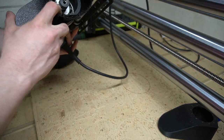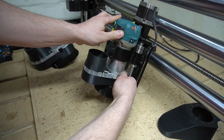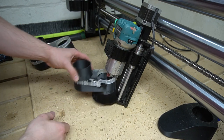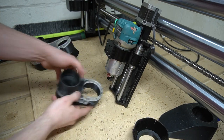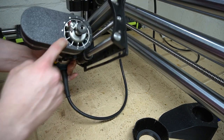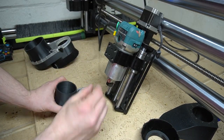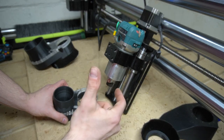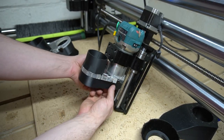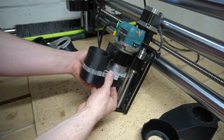The way I designed this is that the hard plastic and the collet nut are pretty much on the same plane, though there is some adjustment — you can adjust it up and down if you need to. What I've seen a few people do is adjust it all the way up, throw it on the Makita router, and then cut off all suction. That's a no-no. You want at least about a quarter inch of space, maybe a little bit more. I'd go with about three-quarter inch of space overall, which is about where mine is. You can get away with going up a little bit if you need to.